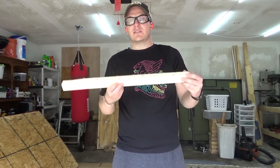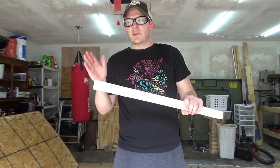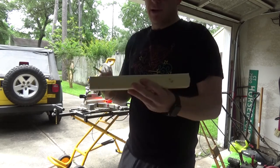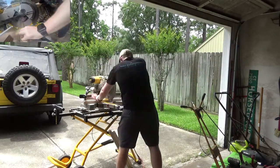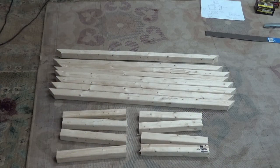If you want to go deeper, you may have to buy another piece of wood to get the bracing needed — or you can go shorter if you want. Now I'm going to start cutting these cross braces to build the frame. I cut one 11-and-a-half-inch piece as my sample and will use that for the rest of the pieces. Once all eight 36-inch pieces and eight 11-and-a-half-inch cross-brace pieces are cut, let's get into the building process.